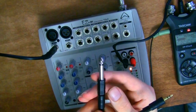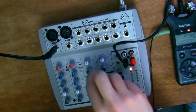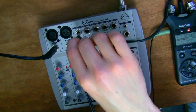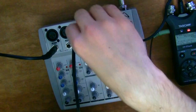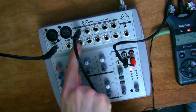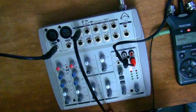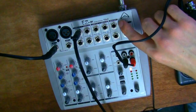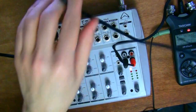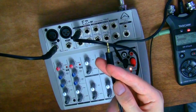I'm going to make sure the auxiliary input volumes are at zero — I don't want any unexpected surprises. I'm going to plug this end into the mono of line three and four. So this is the first input, the second, then three and four being left and right, five and six, seven and eight, nine and ten, and that's main out. So if I had two speakers, I could plug left into here and right into here for loudspeakers at a live event.